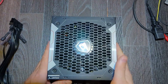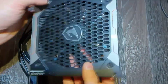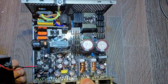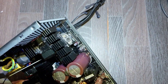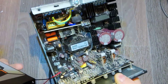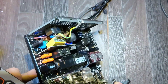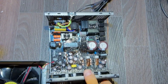Remove the screws and let's open it. By the way, it's really clean, which is unusual - probably the power supply is a new one. Maybe it actually wasn't at work. Probably there is a faulty element somewhere, or maybe a bad joint by the manufacturer. So far we know that the standby voltage is present and the fuse is good, so the caps are charged and we should be really careful and not touch everything.